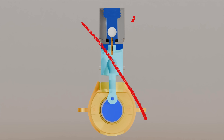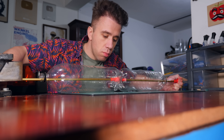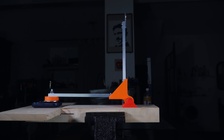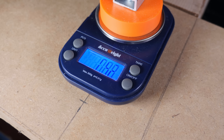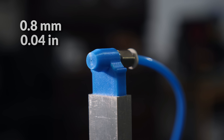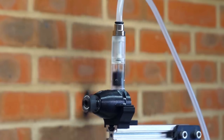I was thinking about what would be a better option than the piston-crankshaft mechanism, and the first thing that popped into mind was: why not just drop the engine altogether and just drill a hole in the cap of the bottles and propel the entire thing like a rocket? So I put two soda bottles together and 3D printed some nozzles. Then I built a test stand — basically just a lever connected to a scale. For the air to last more than a minute, I had to use a nozzle with a diameter of 0.8mm.